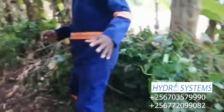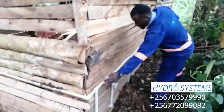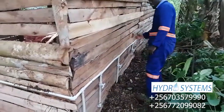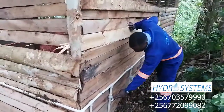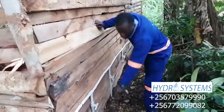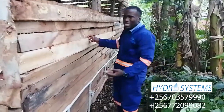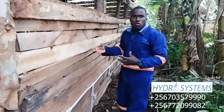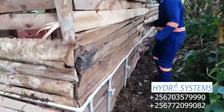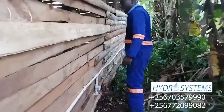Like I said there are six of them. As you can see, this is the main supply, and for every nipple we have put inside, we have provided a ball valve and a control valve so that we regulate the amount of water that goes inside. We do not want a lot of water wasted by the pigs. So this is where we control it from, regulating the level of water — six of them as you can see.